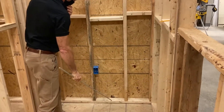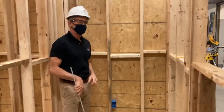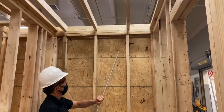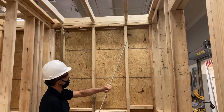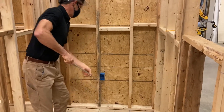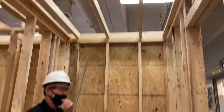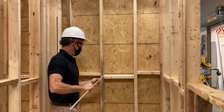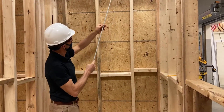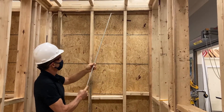That's one of the main reasons why we moved away from balloon frame walls. Back in the 1920s and 30s, we would build walls all the way from the first floor up to the roof and then attach the floors to the walls. We later learned that if a fire starts down below, it quickly flies up the wall cavities into the roof system and burns the house down very fast. So we changed to platform framing — it's more efficient, faster to build, and the double top plate serves as a major fire stop, slowing the fire before it travels into the ceiling.